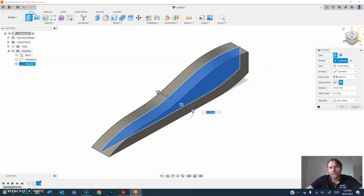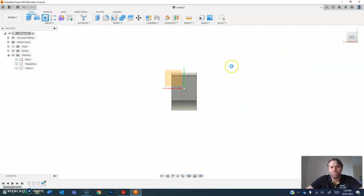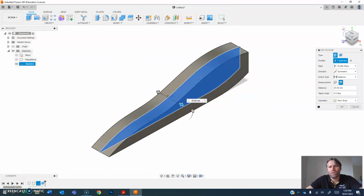So because our hole in the back is a 19mm hole, because it's a 19mm hole, and I need 3mm on either side of it, 19 plus 3 gives us 25. So 25 would be the minimum. Again, don't forget, we want to add a little bit extra, just tolerance, just in case we sand it off. So 26mm is what I would recommend that you make the width of your body.